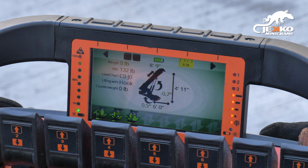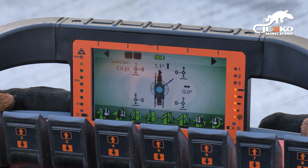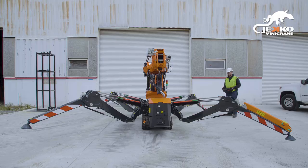Outrigger lifting and lowering mode allows you to drive the left and right tracks, extend the tracks in and out, and control outrigger rams up and down, and activate auto level. This screen indicates your X and Y axis. The outrigger will highlight green when the crane detects proper ground pressure. The auto level button is located on the left side of the remote. Holding the button will activate all four outriggers and auto level the crane.